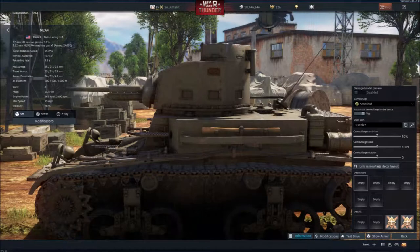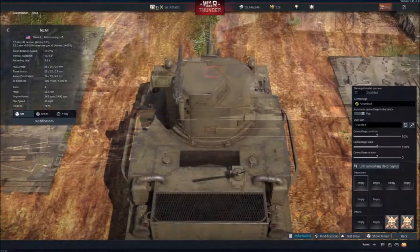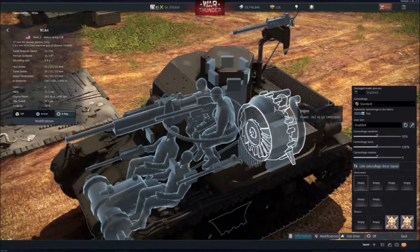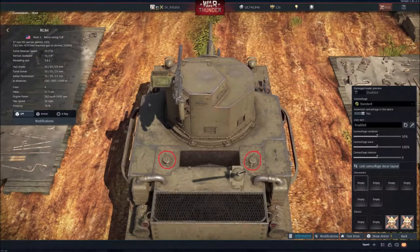On the right side of the turret is a brass placard, bearing the emblem of the United States Cavalry, meaning that this is an army tank and not one belonging to the Marines. The engine deck features two large ventilation grills, the smaller one for air intake, and the larger one for air expulsion. The engine is air-cooled, so it has a large fan to shift all that air. On either side of the air intake is a round object. These are the fuel filler caps. Two fuel tanks, two filler caps.